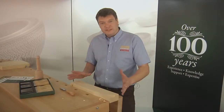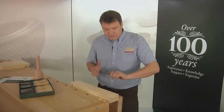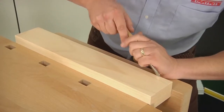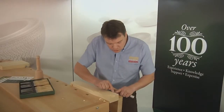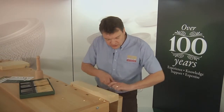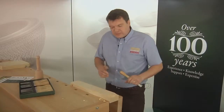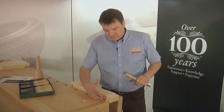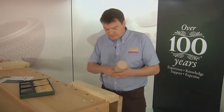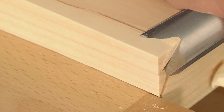Let me show you on this piece of timber here. All right, so carving left hand side of the bench. So I hold the tool in my left hand. I want to round this corner over here. So I'm going to cut these short fibres to long, and the long fibres of the timber will support the cut. Can you see? If I wanted to round this edge over, but I cut long to short, take a look at what happens. You see how it just splits?